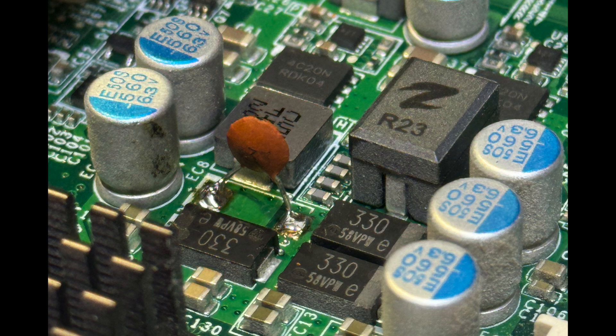However, I'm not surprised that it worked, because before I replaced the capacitor at all I did fire up the board and it functioned fine. I guess that's because there are five of these tantalum capacitors in parallel — four on top, one on the bottom — and any one of them is only contributing to one fifth of the whole. That also means you could probably make this repair by just desoldering the bad capacitor and not replacing it at all.